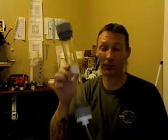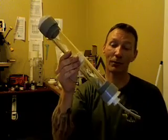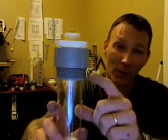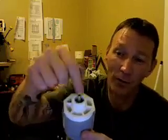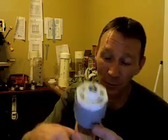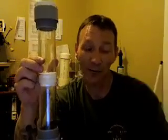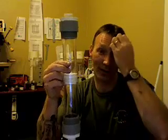We'll try this out and see how it works. I think it'll work for my booster and for my truck. Now, where do you get these pieces? The gray pieces, you get in the electrical section of Home Depot — it's for electrical conduit tubes. It's two inches, threaded up here but we don't use that. The two-inch acrylic just fits right in there — perfect fit. The white pieces are end caps with a female portion and the male plug — you'll find that in the plumbing and PVC section. The brass fittings I found there as well. One-way check valve — check McMaster-Carr or just Google it. This check valve is a one PSI that will allow the air to go through, and I haven't had any problems with the other bubbler, so this should work out pretty well.